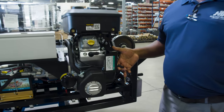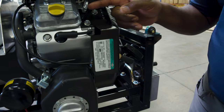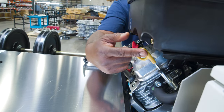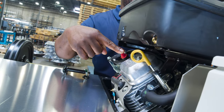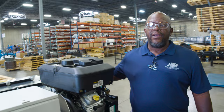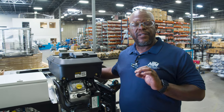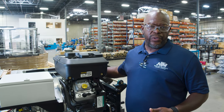You've got control of the machine itself, or the speed of the roll former, with the throttle. You have your choke here, your oil filler here, your dipstick is on the other side, along with your gas shutoff which is the red knob here. It's very important that when you're operating, transporting, or storing the machine we want to turn that gas off and run it completely out of the carburetor so that we don't have the issue of flooding or anything when you're going down the road.